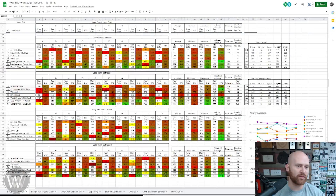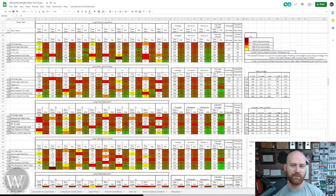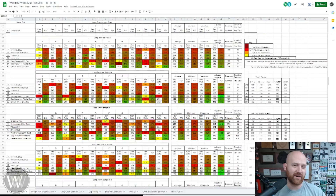Particularly the two hide glues, because I had a lot of people wondering what's the difference between the homemade hide glue and the store-bought hide glue. So the interesting thing is to see all of the raw data through here and then all of their averages combined. What I have here is their average — just the numbers, where did they actually break, what is the breaking strength that I measured. And then over here I have adjusted, and that is from the breakage. If it was 100% wood, I gave it another 100 on the adjustment; 75% wood breakage gets another 75; 50% gets another 50; 25% gets another 25. Those are really very subjective — not objective — but I want to actually capture that data.